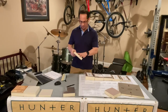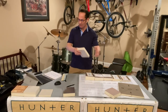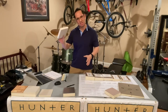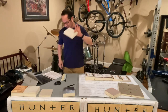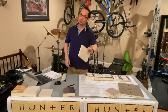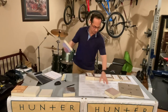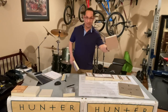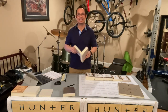Okay, this stuff is a lot more fireproof than your paper facer, or the glass reinforced GRF for the polyiso. This is CGF, coated glass facer. Type 2, class 2, grade 2, or grade 3, okay? It's still type 2, grade 2. Where does it differentiate? It is in the class.